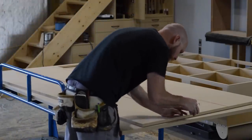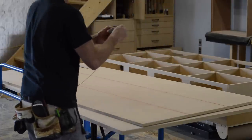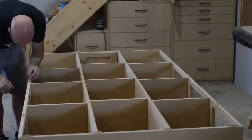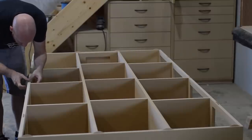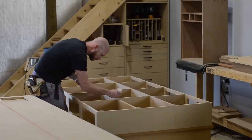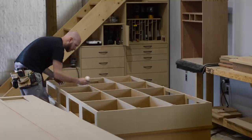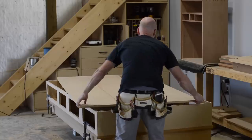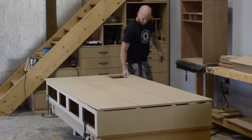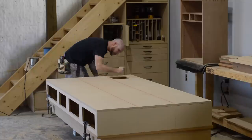Now I'm marking the location of the grid work on the underside of the bottom piece so that during glue-up I'll know exactly where to nail. I put a tiny amount of glue on these biscuits just to hold them in place so they don't shift during glue-up. Now I'm ready to glue the bottom on — as mentioned earlier, the glue line between the grid work and outer layers is where a torsion box gets its strength, so this is really important. One side benefit of using biscuits for alignment is they act as a standoff so as I'm sliding the piece in place I don't smear too much of the glue off.